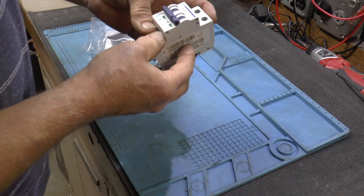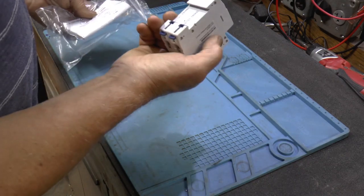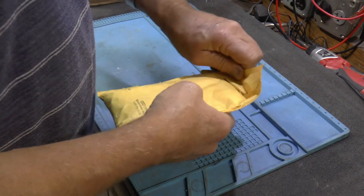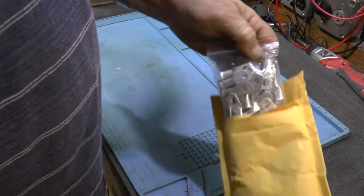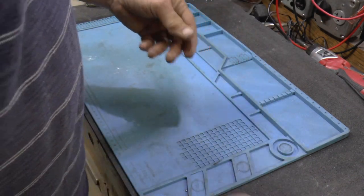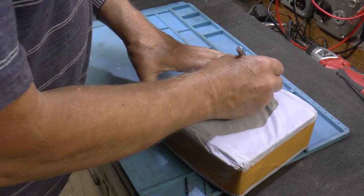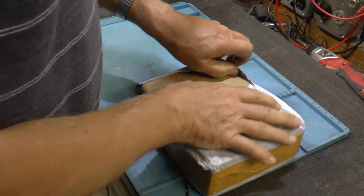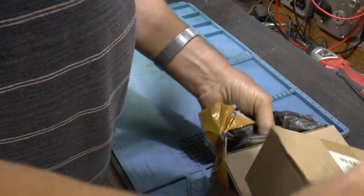I'm thinking of the LV6548 or something similar — going to go 48 volts and 5 or 6,000 watts. Everything is working so well that I decided to go ahead and expand things. So I had to get a new circuit breaker for my box because the new one will have more going out. And for that number 4 wire, I'm going to need some ring terminals, so I got those. I used all the other ones on my battery box build. And I need some disconnects for the solar inside — my existing ones are only good for about 24 volts.